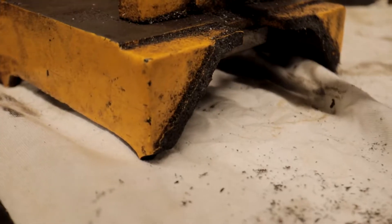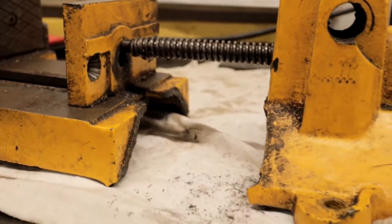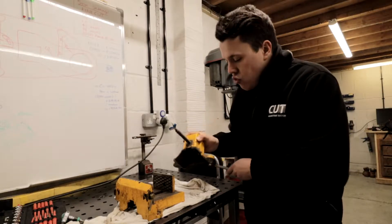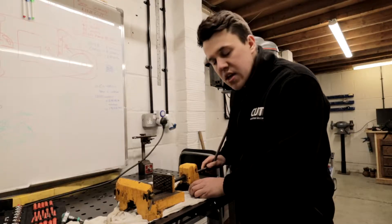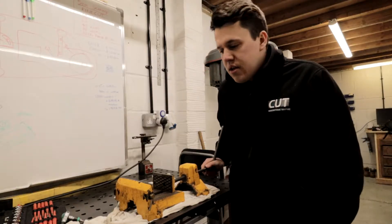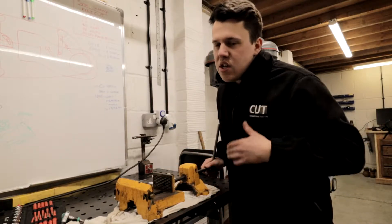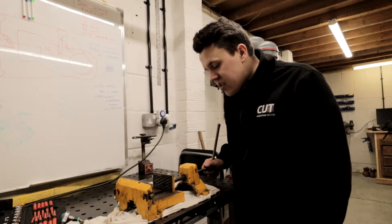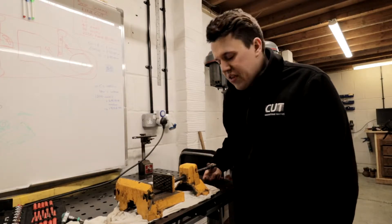It's not actually crazy thick — I thought it'd be a bit thicker — so I can kind of see why it cracked here out of all places. It's just a bit thinner and not strong there. We'll grind that out so we've got somewhere to put the filler, then grind it back and I think I'll weld it in situ. Because where I weld it, it's bolted in four points with the mechanism in place, so I can ensure it's sliding fine before I weld it. I'm going to clean this up and get ready to tack it in place.